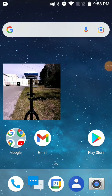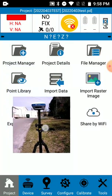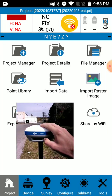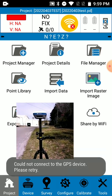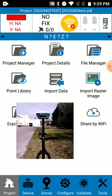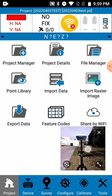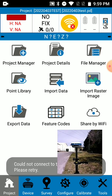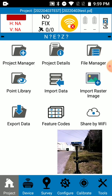The first thing I'm going to do is open up Cube A software — I'll update later. We need to turn on the S700A; just push and hold that button. When it turns on, Cube A is going to pair with it via Bluetooth and connect to a local VRS network I've already configured in the software, and we are going to get an initialization and fixed position.